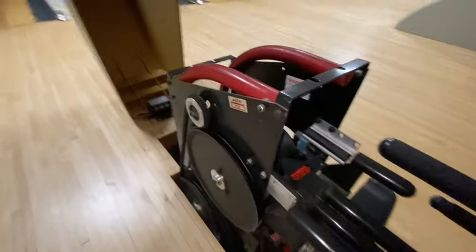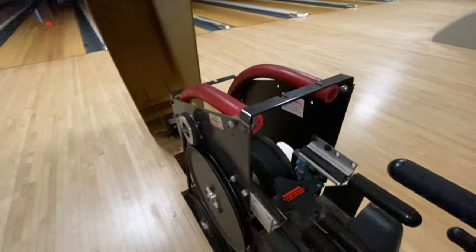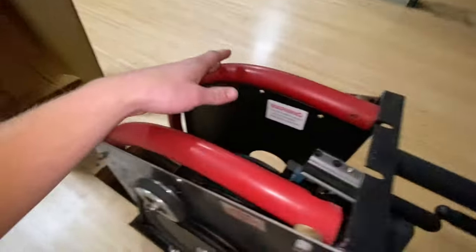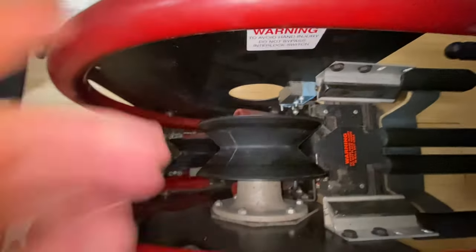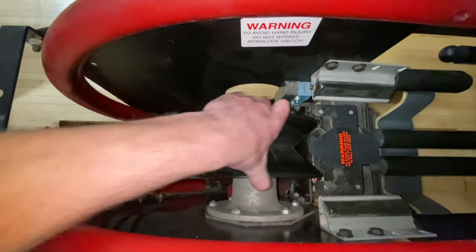The main components of the C90 are the lift rods. There are four of them on each unit — two on the top, and if you look down in the back, there are two more on the bottom. You also have two lift wheels; you can see these two V pulleys on the top and another one on the bottom.